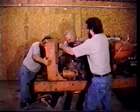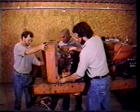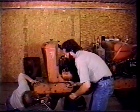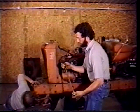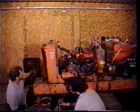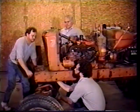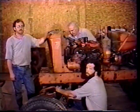It's on? Yep. I gotta back up a little bit on the top here. And the top's on. Okay. What I gotta do is get the bolts lined up now. Oh yeah, just line the bolts up in the bottom. How's that long punch here? We're using a long extension with a swivel socket on the end to reach all the way up there to get to it. Tighten them down and tighten up the clamps and put your antifreeze back in.